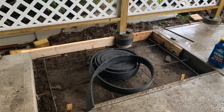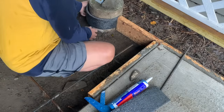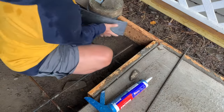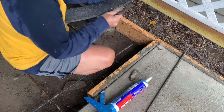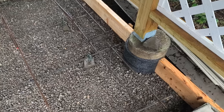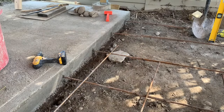I didn't find much on YouTube about putting a slab around a pier, so I'm keeping them separate using an expansion joint. The pier is below frost line but the slab is basically floating, so with the heaving process it might pull or crack the slab or the pier. I thought this approach was helpful.